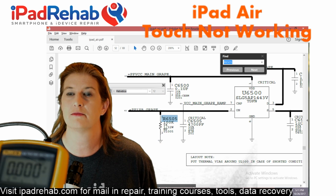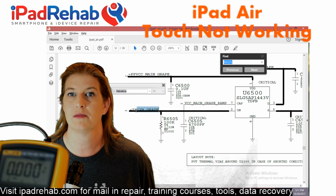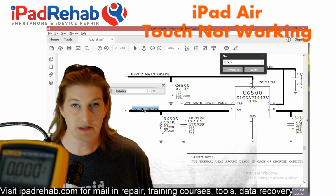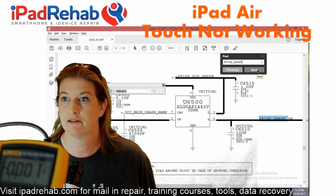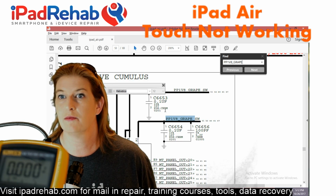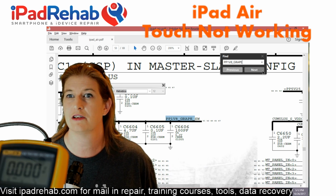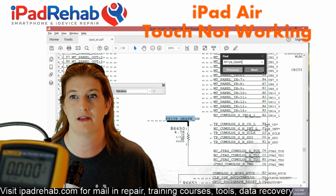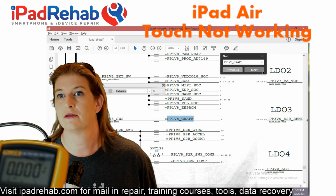So we've got to follow the problem back this way now. Let's find out what we can about PP1V8 grape. What do you do, PP1V8 grape? Let's see, where else do you go? All right, so we don't care about PP1V8 grape SW. We know why he's not there. We just care about PP1V8 grape itself. So let's see, where is PP1V8 grape? Here we go.